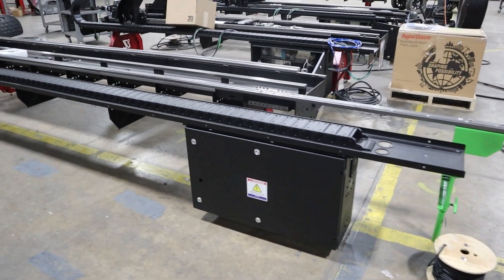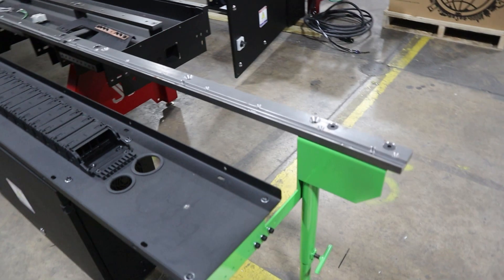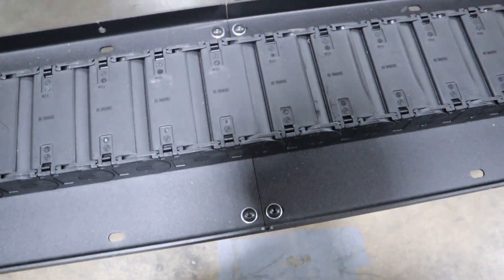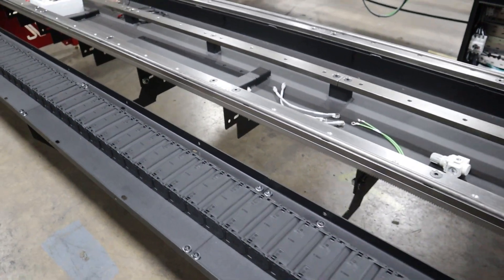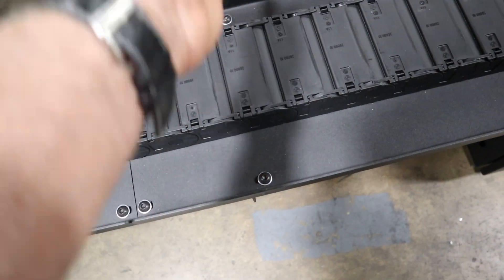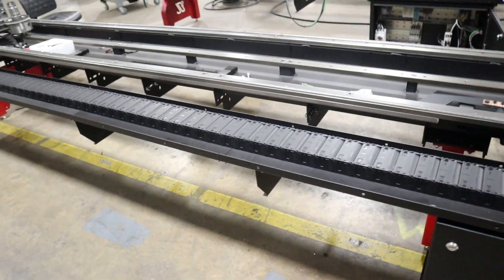Okay, I've come over, and this is how we wire them. We have this green extension right here, and basically that way it mimics the midsection where we don't have to put the midsection in. Your normal midsection would be there, and then you would have your bracket that would bolt right there. So we have the existing holes right there — we're going to remove these right-side bolts, add that one bracket I showed you, and be adding that bracket. We had the bracket down there, and then we added this one here. Those are the holes I was telling you about, the slots right there. This is what's going to attach to this bracket — that's why we need the leg facing that way. And then underneath here, we reattach this with that plate underneath it, and there you go.